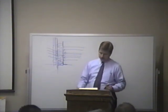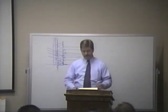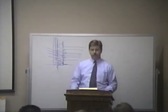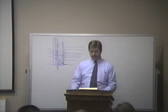So look at the infiltration of a hole that size, the impact it would have. Some of the contractors that we perform inspections for, their rough openings are much too deep for the windows. Sometimes they'll have a half-inch gap all the way around, but they don't even address that, like putting in stopping insulation or something like that. They just go ahead and put their materials over that. Now, somebody's going to pay dearly for that, along with what that house needs.